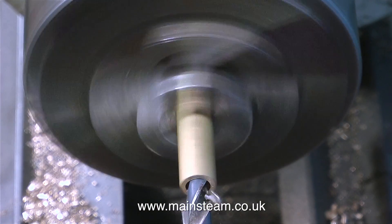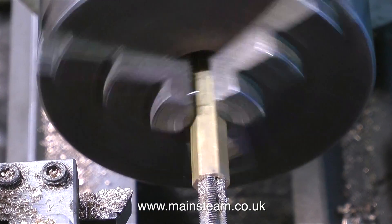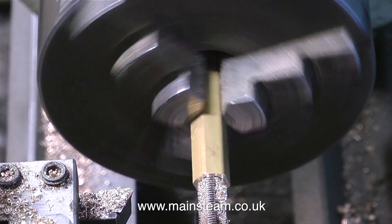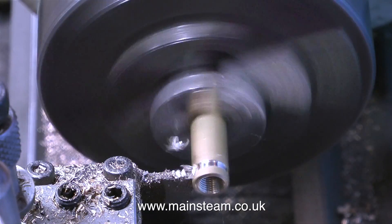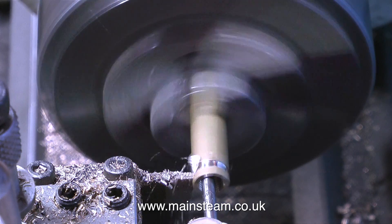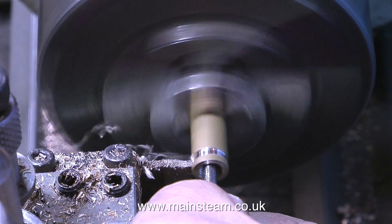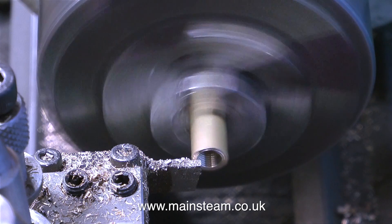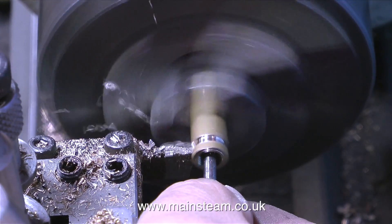I've sped up the repeat procedure. I'm drilling a hole in the centre of a piece of hexagon bar, and I'm going to make some nuts with an internal thread 5/16ths by 32. These finished brass nuts will allow me to tighten my superheater into the fitting at the top of the boiler. At parting off time, I'm using the back end of a tap to catch the part as it comes off the main stock. I threaded enough hexagon bar to part off more than two nuts, because it's good to have 5/16ths by 32 nuts in a tin in the workshop for instant access.